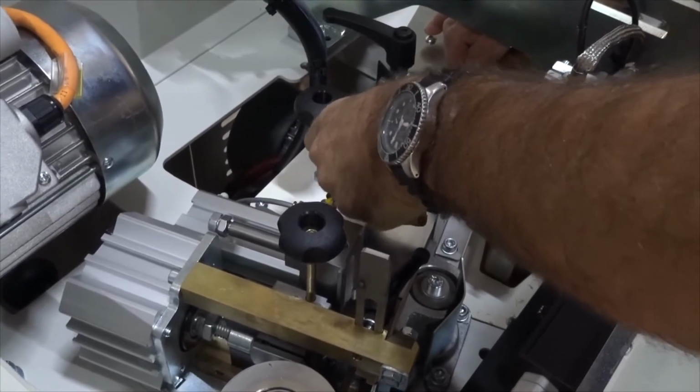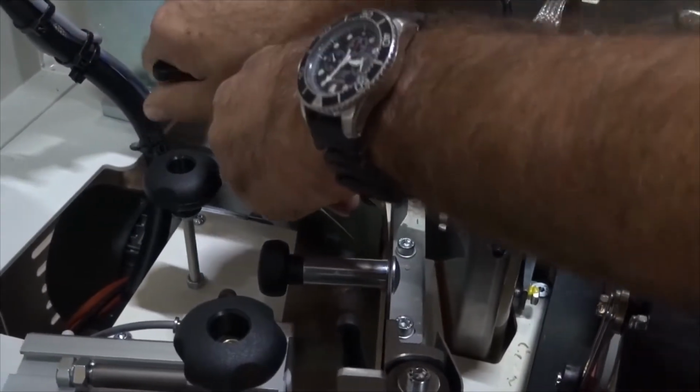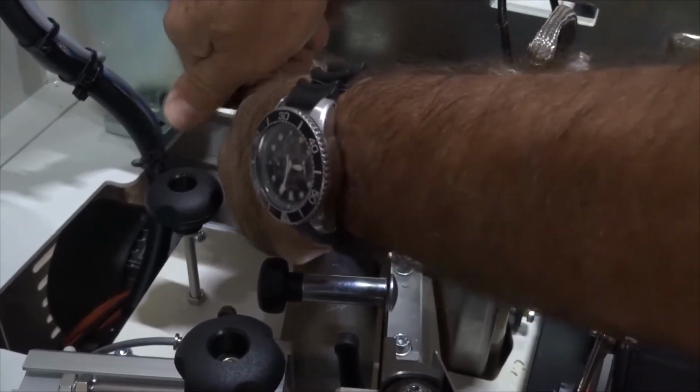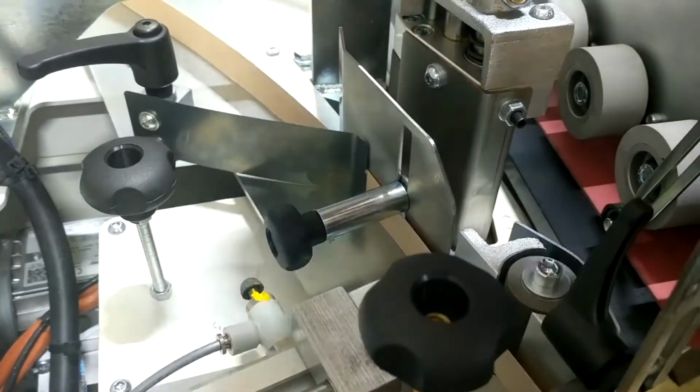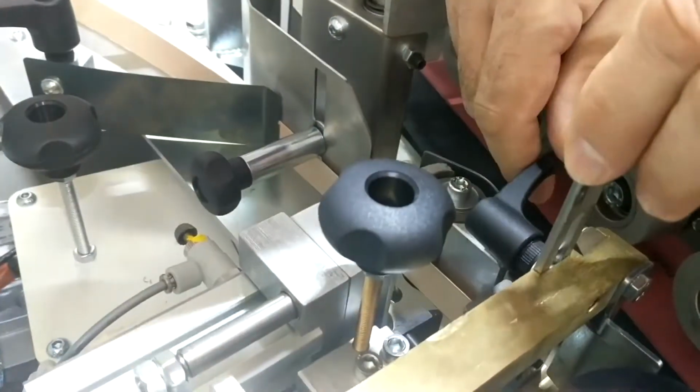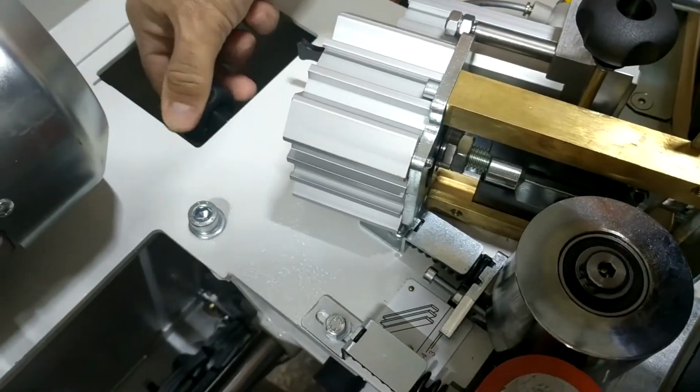To load the tape, loosen and lift the height limiters and feed the tape into the chute. Set both limiters so there is approximately 1/2 millimeter of play. Position the leading end of the tape just at the initial shears. And then you want to double check the pressure rollers to make sure they are set to the 3mm or less line.